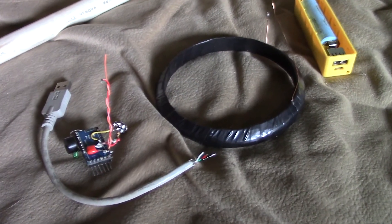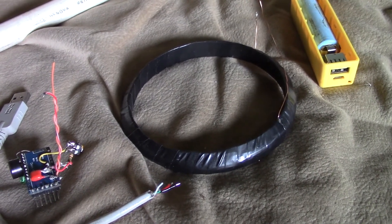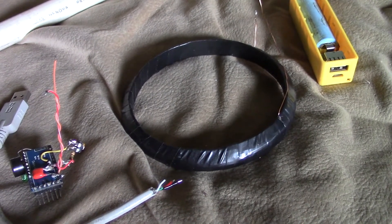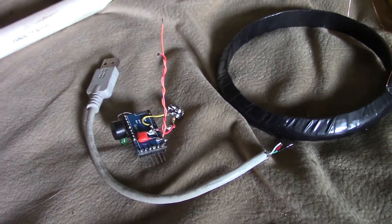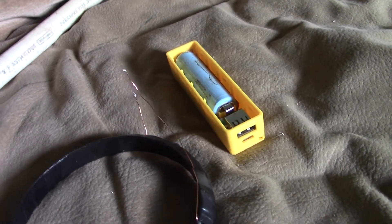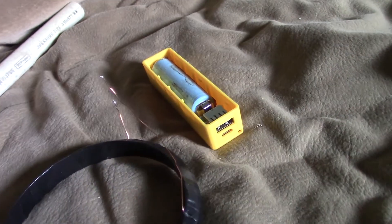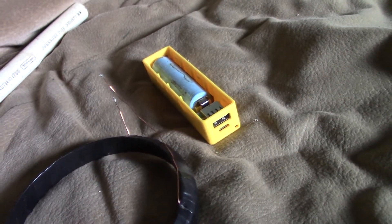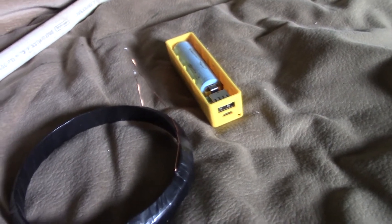So here's what I've done so far — I've wrapped the main coil with electrical tape, and that should protect it from moisture. I'm going to put this USB lead on instead of using a 9V battery, and that'll allow me to connect to one of these power banks. These are only about a dollar for the bare unit, and I've put an ex-laptop 18650 cell in there — the output's always five volts. When it runs down, I can just plug a micro USB lead in and charge it back up again, so I get a good idea of run times too.